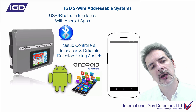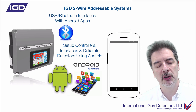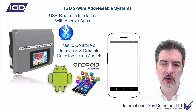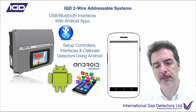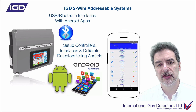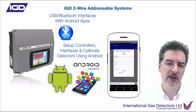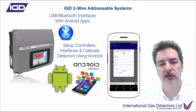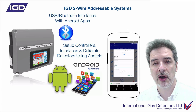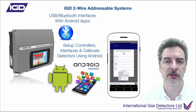We mentioned Android apps. The larger panels have an Android interface, and all of the panels — either via USB or the detectors via cable input — allow you to connect to Android devices, whether that's an Android mobile phone or an Android tablet. That allows you to interrogate the system, configure devices, do calibrations, do diagnostic work, download event logs — all using your Android device. A really modern approach to how you're going to connect and leverage data out of the system, how you're going to control it, and what you're going to do: set up commissioning on site, normal operation, and all sorts of other things.